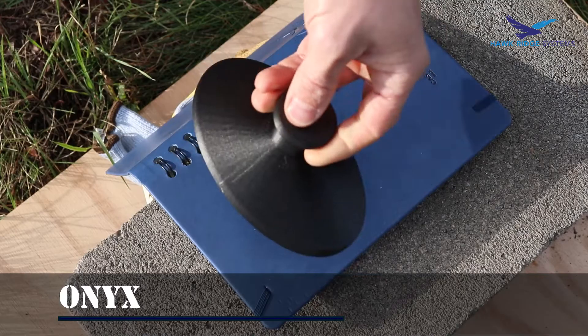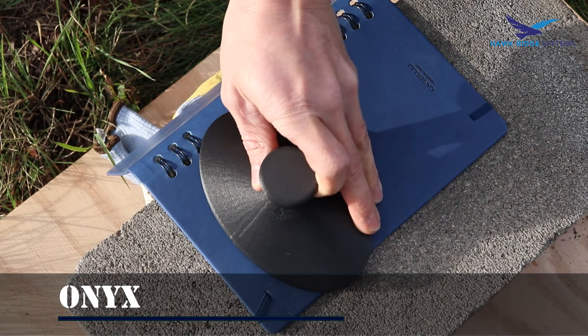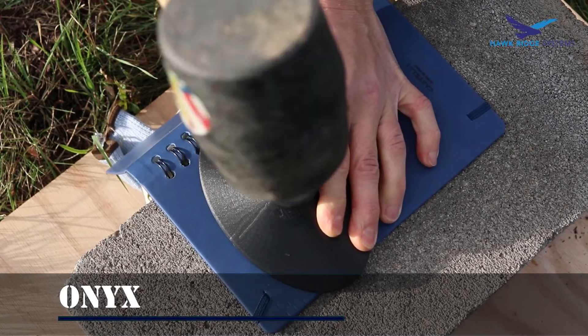Onyx is a little bit stronger and more durable than ABS, so if you're going to do any type of tooling similar to what we did here, the Onyx is going to have some pretty good longevity as compared to PLA or ABS. The other thing I'll mention: Onyx has a nicer surface finish on some of those edges that we actually use for the tooling — just from the way that the Markforged technology works, you get a pretty nice surface finish, which works for a nice clean crisp line when we looked at the emboss.